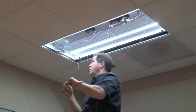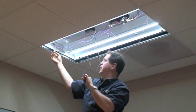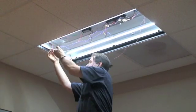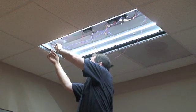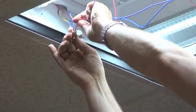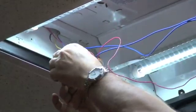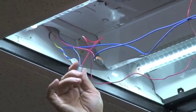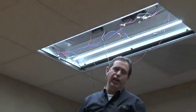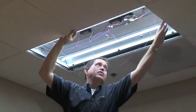On the ends I use some quick disconnect plugs. We have these available for dealers if they'd like to get them. They're wonderful little connectors because they just have a little lever on there. You strip the wire back like this and pull the lever back. Engage the raw copper into the back of the connector and then snap it shut. Give it a little tug to make sure you have a good connection. It's a UL approved connector and it's a forever connector — it'll last forever. It's very high quality; they're made in Germany. We'll make that connection there and now make the connection on the other side.